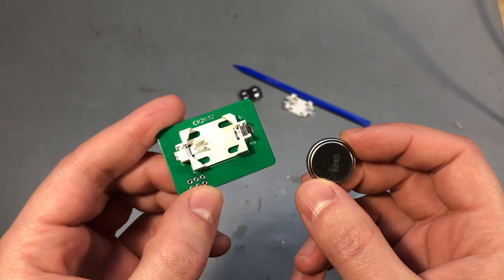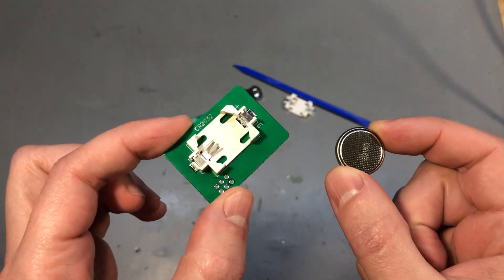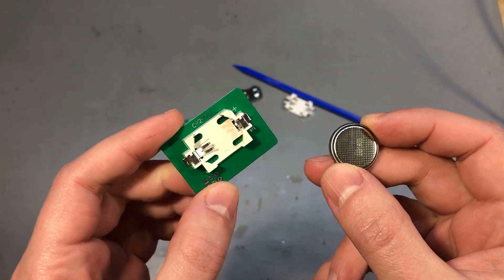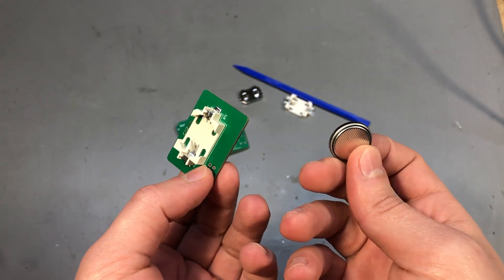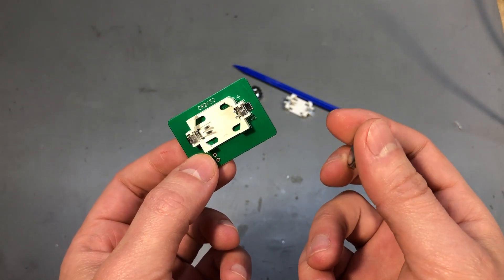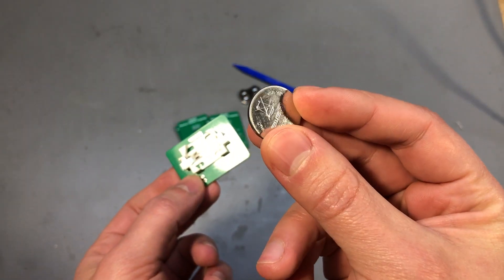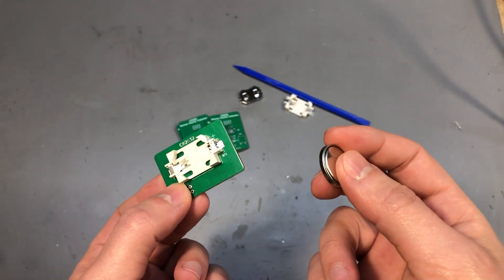Now when you start talking about low power devices, specifically those powered by coin cells, it gets a little tricky to get some reverse polarity protection into your circuit. Because our battery voltage is now just 3V, we can't afford losing 0.5V on our input diode — that will ruin our battery life, it will waste the little precious energy we have stored in the coin cell, and that might prevent our circuit from powering up.